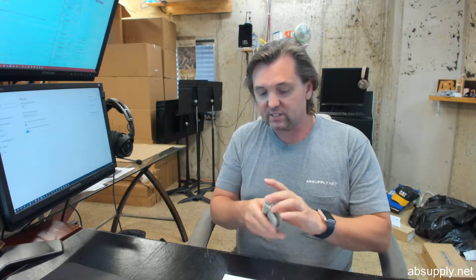You're going to want to install your spring hinges, it is indicated there, middle and bottom, not the top. If you've got 3 spring hinges, you'll obviously occupy the top location, but if there's 2, go middle and bottom. The top hinge is the hinge that does all the majority of load carrying of the door. 70% of the door weight, in fact, is held by that top hinge. And technically, spring hinges are not load rated at all. So put your spring hinges at the middle and bottom. If you've got one, put it at the bottom. Middle would be okay, but the bottom would work.